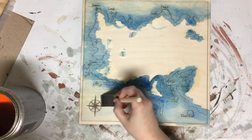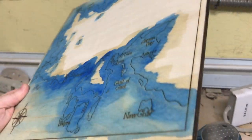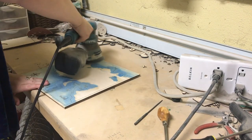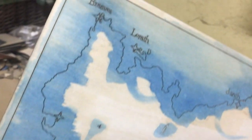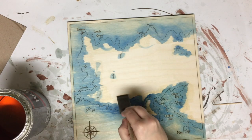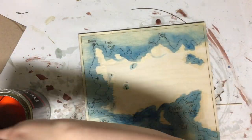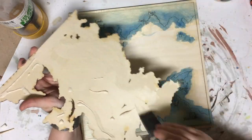I don't apply polyurethane to the wood that's going to be covered up by the next layer — the glue grips okay to the polyed surface, but it grips much better to raw wood. With one coat of polyurethane, in person there is a faint hint of shine, but for the most part you'd barely guess that it's got a finish applied to it at all. That's all the more reason it's important to me that I sand and apply a second coat. After sanding, it looks lighter and dustier with no gloss anymore, but it feels dramatically smoother to the touch, and that'll show once the second coat is applied. I wipe it down and use compressed air to clear off the dust, then apply the second coat of polyurethane to everything. The second coat has to be applied much more slowly and gently than the first, in order to avoid any excessive bubbles that could disrupt the finish. I also applied the second coat of poly to the land masses too — let's just pretend I didn't lose that footage, it's nothing you haven't already seen.